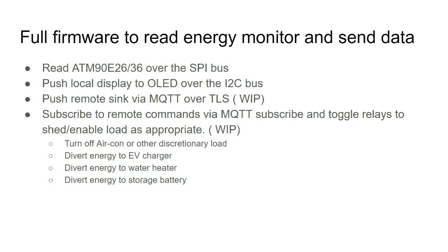So this is the plan. Read the device that is measuring your energy, have a small OLED to show what it is locally for debugging. OLEDs are really useful for debugging. Push it to a remote sink over MQTT with TLS. And then also, because MQTT lets you subscribe to stuff, you can drive relays and such out of the energy monitor to say, I'm going to turn off my aircon, or I'm going to direct energy to an EV, a battery, or a water heater to store it.